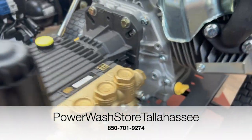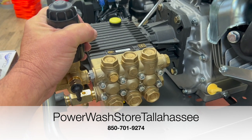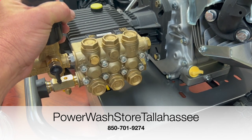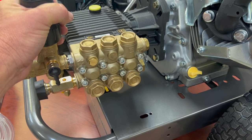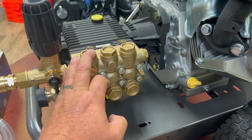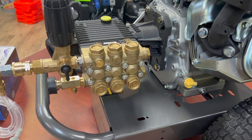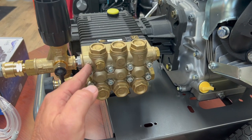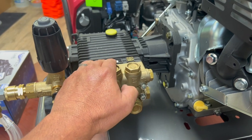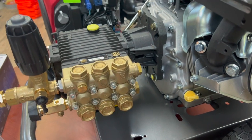More bad news about direct drives: typically speaking, most direct drives will not pull from a static water source. Meaning you can plumb this into a tank and it will most likely not pull. You could get it below the gravity level of the tank — it may prime itself and start pulling — but you really can't guarantee that a direct drive will always pull from a water source. They need to be fed.